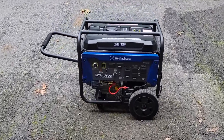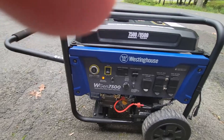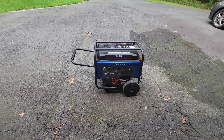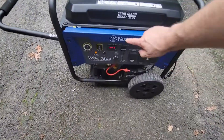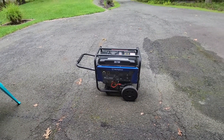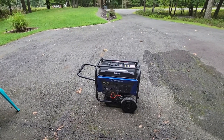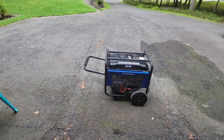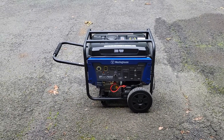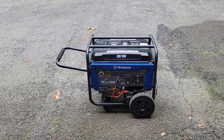As far as starting it — you probably know this already — I'm just going to flip on the switch. The light lights up, and now you can use the remote to get it started. With the remote, you're just going to hold the button for a second or two and it'll kick over. I let it run for about 10 minutes. It's nice and hot, so it's important to let it cool before you put it back close to a wall. Obviously you don't want to cover it until it's cool. In summary: keep your battery charged, keep your generator filled with fresh fuel that's been treated with a stabilizer, and run it every couple of months to keep everything lubricated.